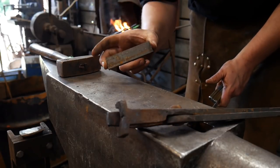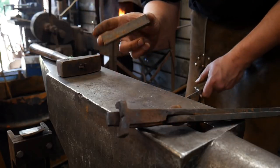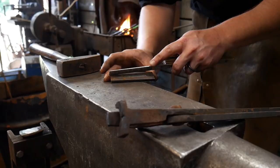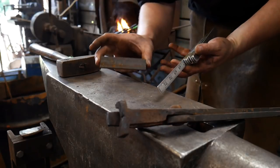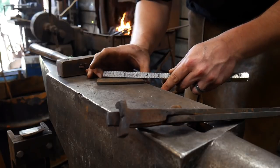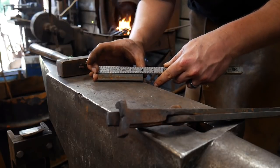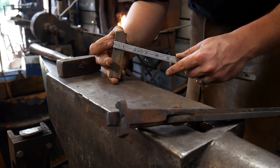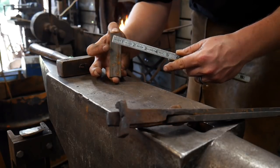Today we're going to make another type of bottle opener. This is going to be a really simple church key bottle opener, but I'm going to do a fan tail style so it'll have a little different styling to it. I'll walk you through the measurements first: four inches or 100 millimeters long, by one inch or 25 millimeters wide, by quarter inch or six millimeters thick.